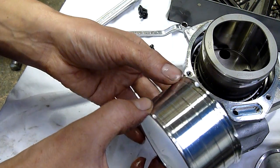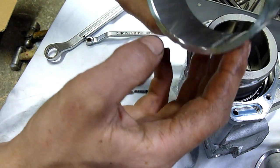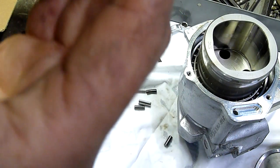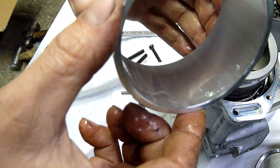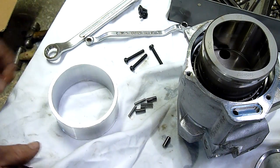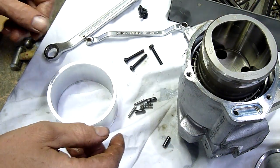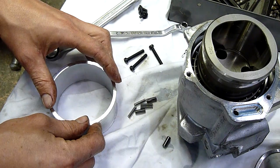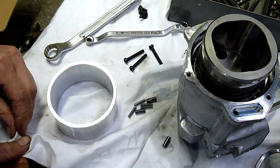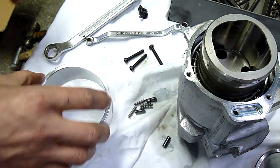There are some scuff marks in there. Look at that. Yeah, there's some unusual looking scuff marks in there, particularly there. It's actually rough. I wonder if the metallic debris going through the injectors was aluminium, not iron. So he did ask if it was possible to engineer a magnetic inline filter, like using steel hydraulic fittings coming off the pump, and just put some donut neodymium magnets in it. But the problem is, if it's aluminium debris like this stuff here, the magnet's not going to do anything.